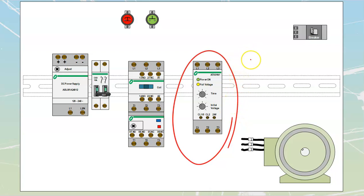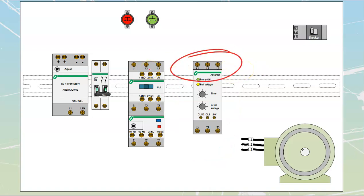There are a number of terminals on here. A couple you should be quite familiar with. First, up at the very top: L1, L2, L3 — these are the line side where you feed power into the component. Down below: T1, T2, T3 — those are the load side where you feed power out. On the soft start itself we also have a number of settings available.